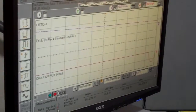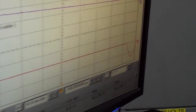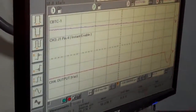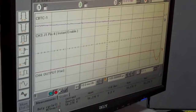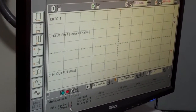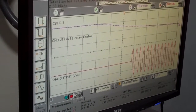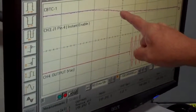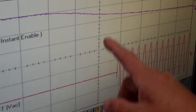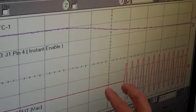Go ahead, Tony. And see here, unfortunately, what we have is a power supply that doesn't drop until it gets to our threshold that we start going. So probably what we're going to do is, go ahead, Tony. There you go. It's not until we get through the threshold that we start to fire. Again, it just happens that in this particular case there is a delay of close to 50 milliseconds.